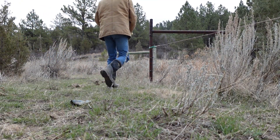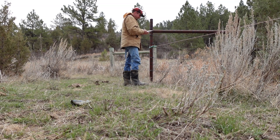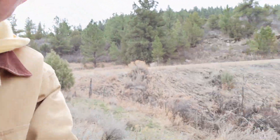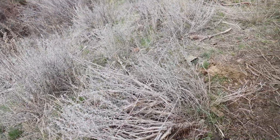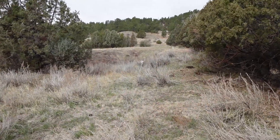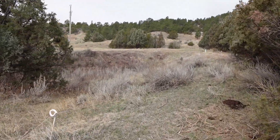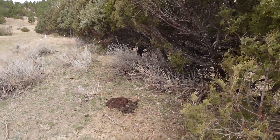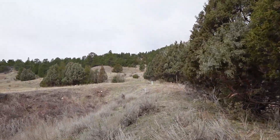We're just going to go ahead and undo the wire here. You can just cut it with a knife if you need to — there's a good knot in there and I don't want to mess around with that. So we're going to go through and pull these posts, which just step into the ground. I'll end up pulling the wire from the other end and grab these posts along here. These posts can be a little bit spendy compared to your regular electric fence posts, but I do like them for ease of putting in — you don't need a driver or a hammer, you can just step on them, unless the ground is frozen, and that does not work.